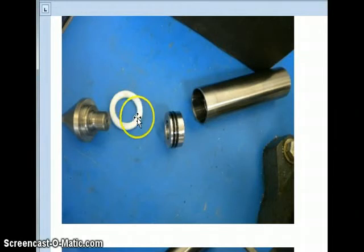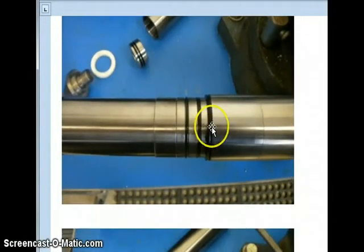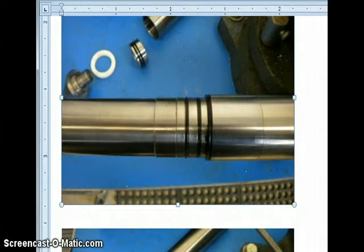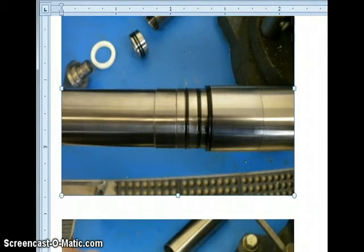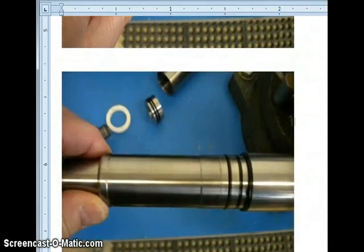Here is the pore pressure element separate from the tip, and a closer shot of the O-rings under the sleeve. This is an X-ring or quad ring which is shown on the surface of the cone, and these are what the sleeve rides on. There is a little bit of motion in the sleeve that you will feel — the sleeve load cell does move. You can see there's a little gap that can be shown and unshown by a little motion. That's normal.